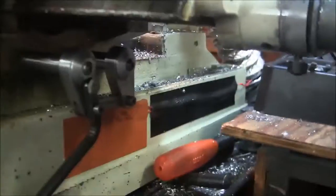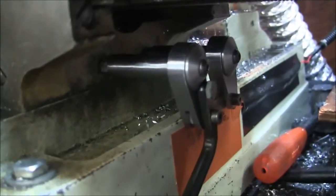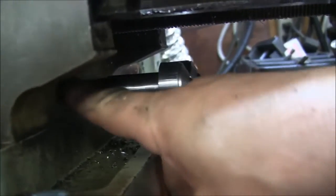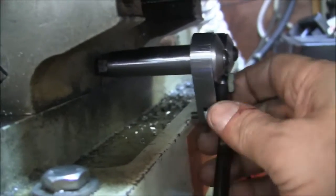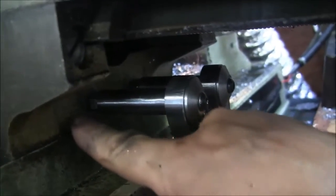Basically, I can't really tell you dimensions for this thing because it's all crazy. I think they just hand drill these two holes - they don't seem to be centered on anything. On my machine they're 2.15 inches center to center. The screw that goes in here is a 5/16-18. And then I have this rod that brings all the lever action stuff out past the casting. These are keyed on here, and you adjust these little nuts to control how far the screws push in when you jack this up.